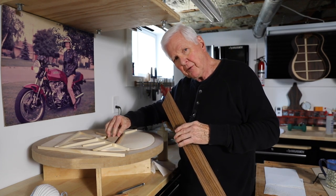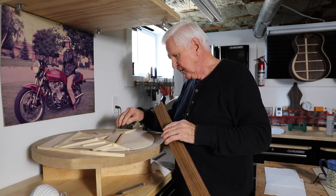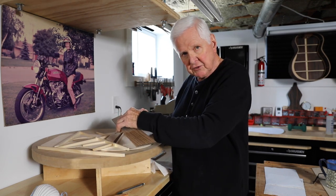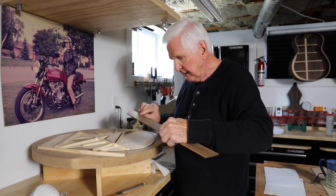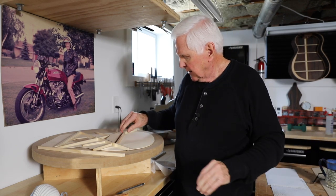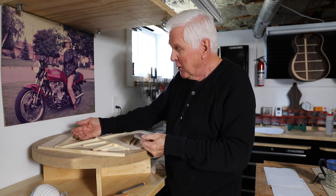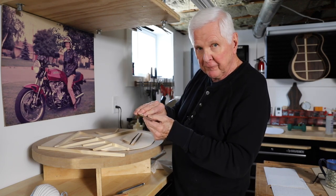Knowing that I needed this to be approximately one and three-quarter inches — or one and seven-eighths; some people actually use two inches — this one is one and seven-eighths. So I ended up measuring down from the top one and seven-eighths, drew my line, ran it through the bandsaw, cut that off, and then I bumped it up against the sander just to take the edge off. That way when somebody puts their hand through the sound hole and feels all the wood inside, they'll feel it nice and smooth.